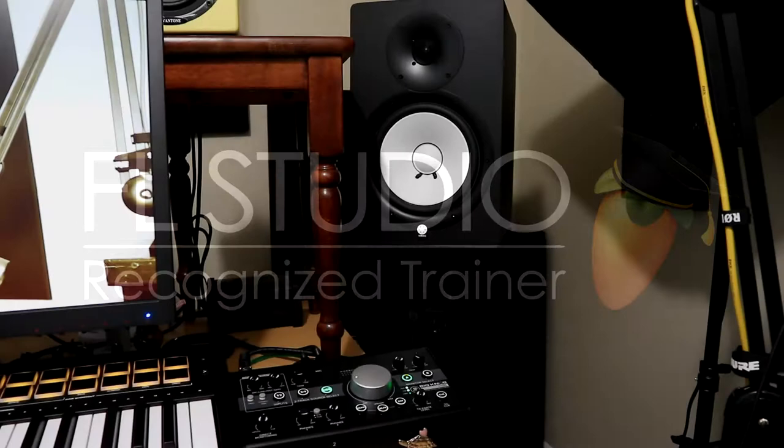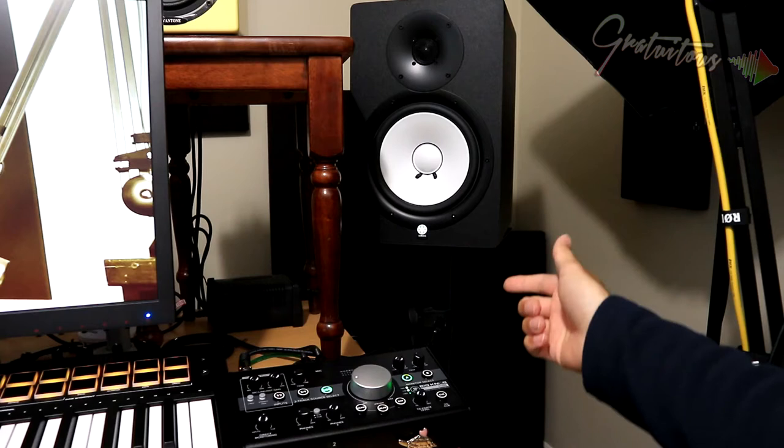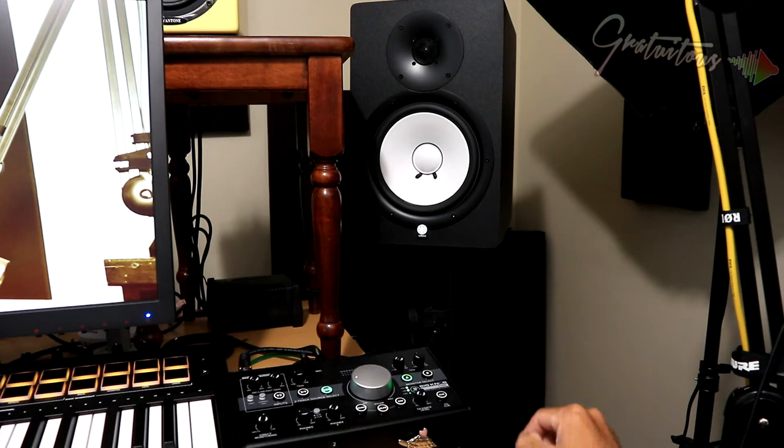In this video, I want to talk to you about why your speakers are popping when you're turning your audio interface on and off and how to properly do it to prevent the popping. So, the whole trick is you want to have your speakers off when you're turning on and off your audio interface. So, watch this. If it's on, you're going to hear a pop. Sounds horrible.